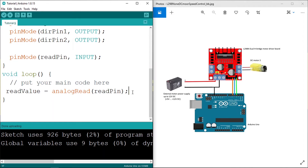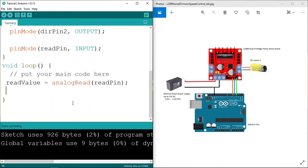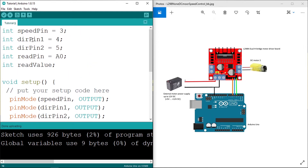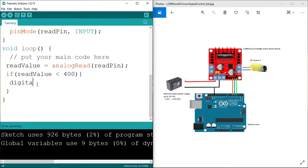Now we can use the variable read_pin and assign the result to read_value. After that we use an if statement to check if we've moved the joystick to the left or right. If the read_value is less than 400, that means we've moved the joystick to the left, so we're going to rotate the DC motor to the left side. In that case we set direction_pin_1 to HIGH and direction_pin_2 to LOW using digitalWrite, and that will rotate the motor to the left side.